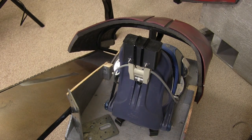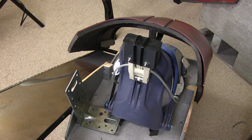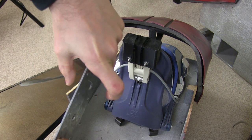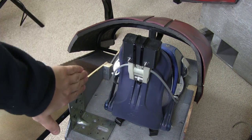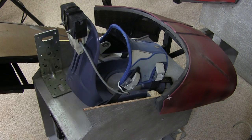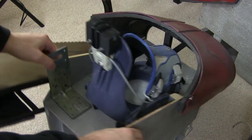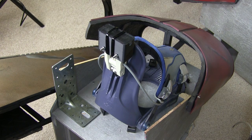It's a couple of days later and I've thought this through quite a bit. The plan is to get these big brackets — which are for joist hanging in house building — and bolt one on each side. I need to cut it up a bit so it fits down the side of my snowboard binding. This is going to have a big peg in it, which is an M12 steel piece of studding with lock nuts on either side to make a pivot point. That's the actual articulation point, so the leg will rotate around and also move sideways. Then on the other side, to lock it, I'm going to have two steel tubes that lock down, making three points of locking so the leg won't be able to move in any direction. But first I need to cut away some of the wood so that the ankle joint is flexible, get this installed, and see how it works.